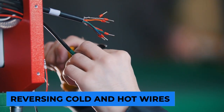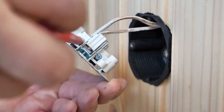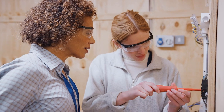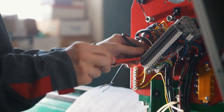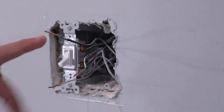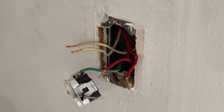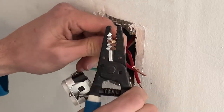Reversing hot and cold wires: when a hot wire is connected to a neutral terminal in an outlet, an electrical shock can occur, which can be lethal. Because the electrical system may function normally despite the unknown threat, you may not discover anything is wrong until someone is electrocuted. The solution is to be knowledgeable with the various colors of electrical wires, their functions, and how they should be connected properly. Outlets and light fixtures should always have white wires attached to the neutral terminal, identified by a silver or light-colored screw. The other terminals should be linked to the hot wires. The ground line will be a green or bare copper wire — connect it to the green grounding screw, a grounded wire, or a grounded box.